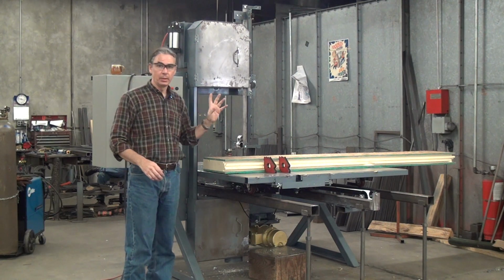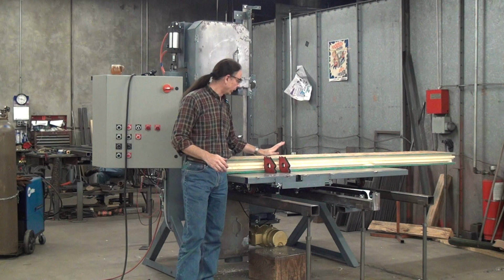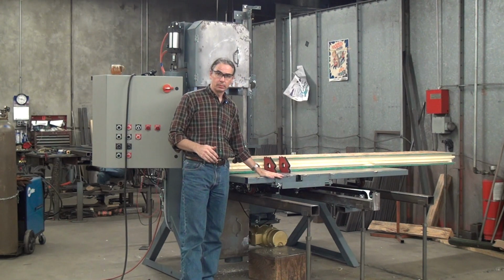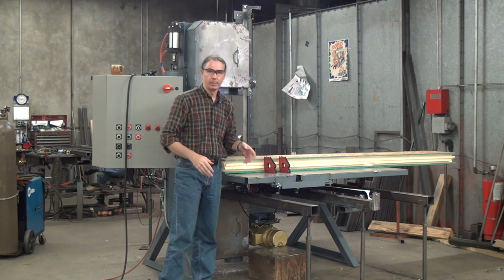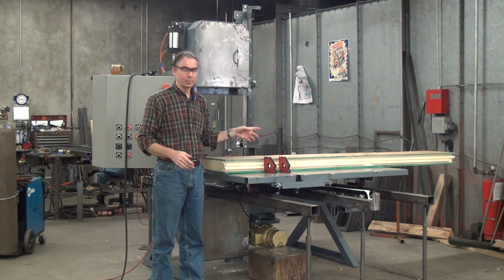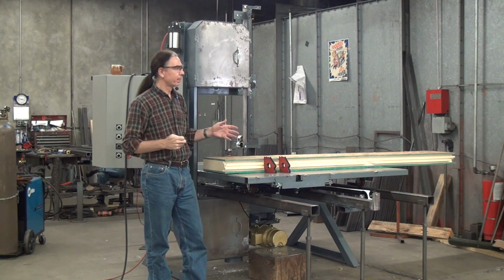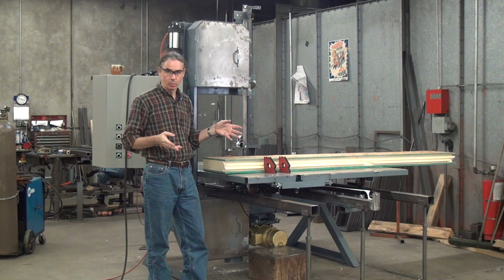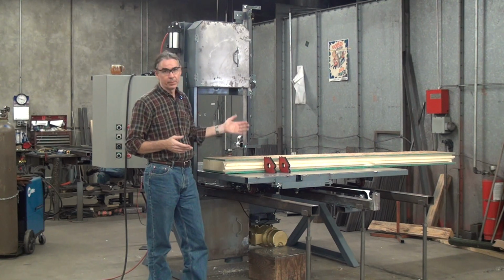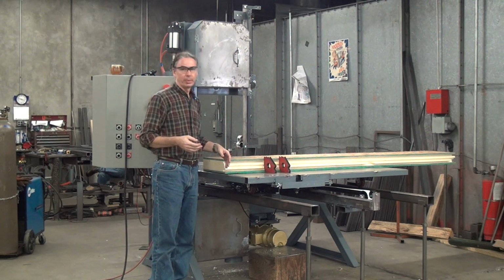This particular machine has a variable speed powered table drive. So we can do this table just as a manual traverse, so put the workpiece on here and push the table to make the cut. This one has a powered table drive. The customer for this particular machine is cutting very heavy items. I think they're cutting either 80 or 100 pound per cubic foot urethane tooling board, pretty big pieces, so heavy. And pushing it would be an option, but motors are better.